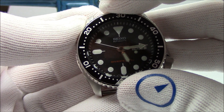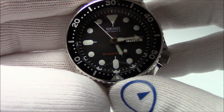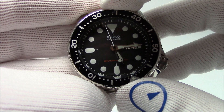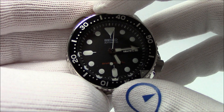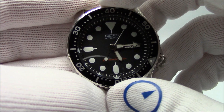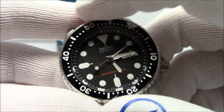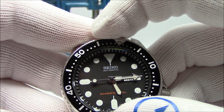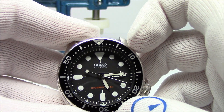If you listen carefully doing the 120-click, each tick is slightly different — maybe it's more of a feel — because every other tick is the same and the one after it is different. That means you're only engaging one of the springs at a time. So that's how they've made 60-click bezels into 120-click bezels: counting the steps, one through nine represents the 120 clicks.